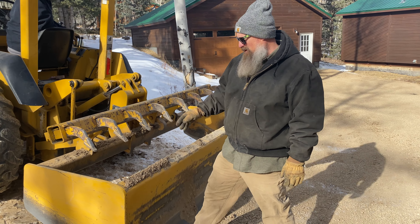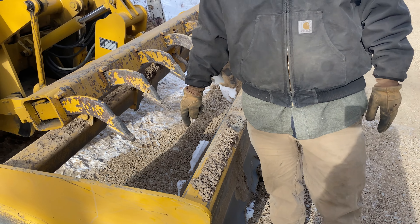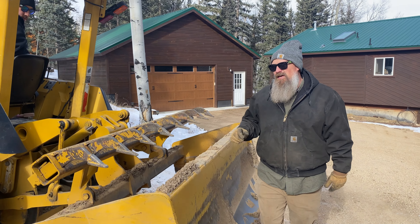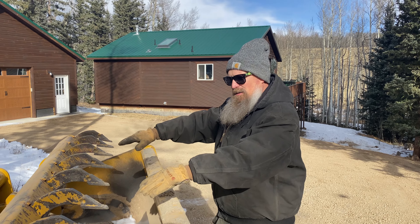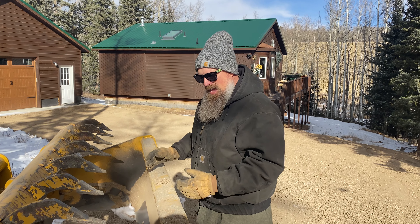This blade on the back has a sister — she lives on the inside of the blade. There's another blade identical to the back blade on the inside, and this inside blade is probably the one we use the most. The way the blade is shaped now, it's digging in. We can back up to it, grab material with the box blade, and move all of it. Because this blade is straight on the bottom and you're going over something with holes or bumps, if the blade is loaded with material, it's only going to deposit it in the potholes or low spots. After a couple of passes with the box blade, you will have a perfect road with no undulations at all because the blade will have compensated and fixed all of that. Then you drive over it with the big pneumatic tires and they pack that binder in.